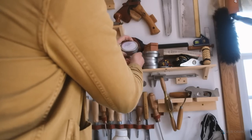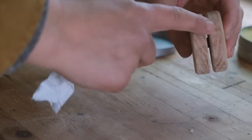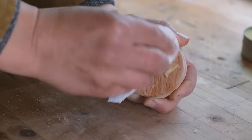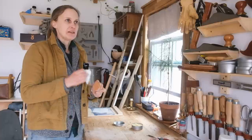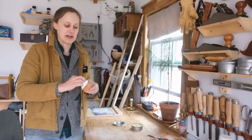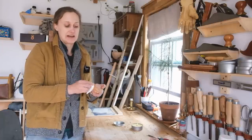Let's do some pine oil. I think it's actually a lot easier to sand these when they're put together - you know, it's faster - except you can't sand the inside, of course. Now when it comes to finishing the yo-yos, this is the situation where I think wax polish is really the best, from a tactile point of view. I don't want a super slippery yo-yo. I think that's part of the charm with the wood - you actually want it to feel like wood. You don't want it to feel like plastic, like a polyurethane shiny surface.